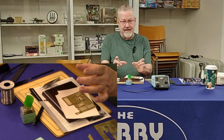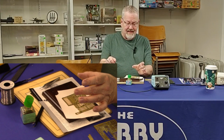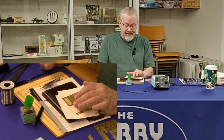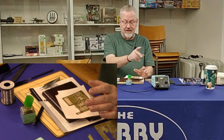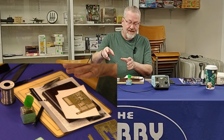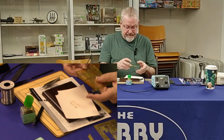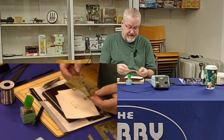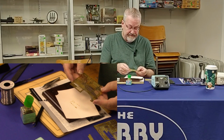So the 2 jars would be suspended, and you'd put the part in one. It would turn a little dirty, and you'd take it out of that, strain it, and put it in the second one. If necessary for something like this, you could do 3. If you don't have an ultrasonic cleaner, just get some jars and just go in order. So you have your first one, second, third. As the second and third start getting dirty, they become the first and second, and you add a clean one at the end. But it's necessary to clean it all, then put it on some paper towel to wick off the acetone. So anyway, those are two different uses of soldering.